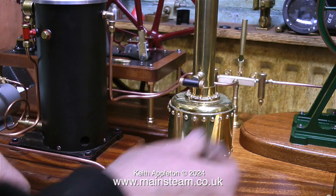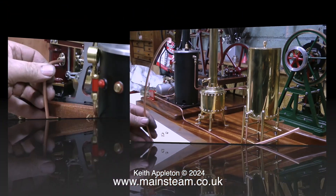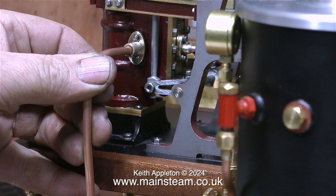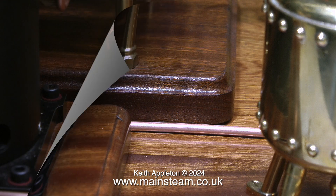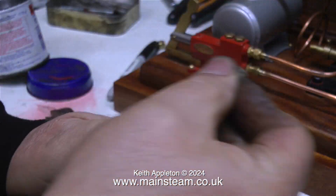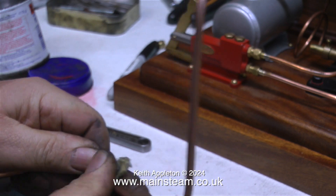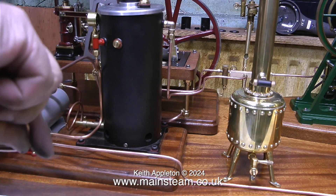The exhaust piping is slightly thicker than the inlet piping — the inlet is 5/32nds of an inch in diameter, and this is 3/16ths of an inch. I'm currently bending the 3/16ths pipe to take the steam from the Vulcan beam engine to the chuff pot. Bending it in the right place is paramount, so I mark it with a felt-tip pen. I generally bend piping completely by hand: you bend the pipe between your fingers with a lot of pressure, past 90 degrees, then bend it back slightly. If the pipe kinks, discard it and use another piece.